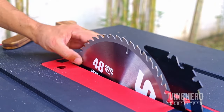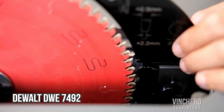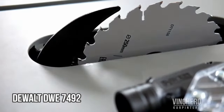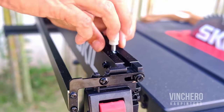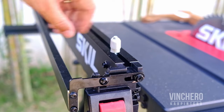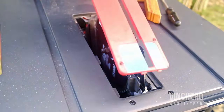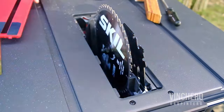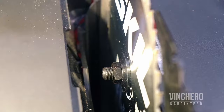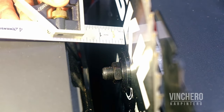This is a true 10-inch blade, meaning it uses a 254mm blade as opposed to the 250mm blade you need to use on the locally available DeWalt — I'm looking at you, DWE7492. The fence also has a T-slot, which is great if you're the type to make jigs and sacrificial fences. The riving knife adjustment is also interesting: once you loosen it, you can't put the blade cover back unless you properly lock it back down — a great safety feature. The riving knife is adjustable too in case it's not perfectly aligned with the blade. And for the dado fans, the arbor is compatible with dado blades up to 5/8 of an inch.